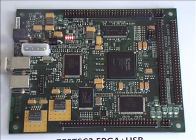The ZestSC2 is used across an array of end markets such as semiconductor prototype and test, industrial control and factory automation, communications, defence and aerospace, with typical applications including fibre channel network monitoring systems, radar and missile control test systems, displays and sensor controllers. And the compelling value proposition of coupling USB with FPGA technology is to provide the designer with lots of flexible I/O, field upgradability of the hardware through FPGA reconfiguration, and the opportunity for local, to the end system, parallel processing of data actually inside the FPGA.